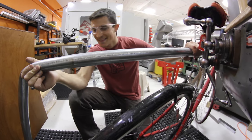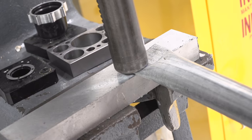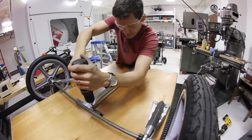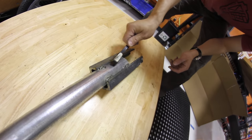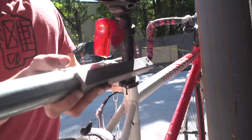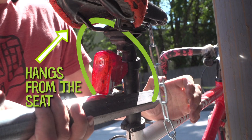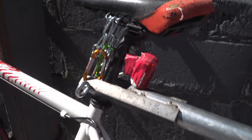Not too bad. Now I'm using a press to flatten the ends of the pipe. Then I'm welding on two bars that I can screw into the bottom of the trailer box. To make a hitch that will attach the tow bar to the bike, I welded on two pieces of angled steel. That forms a slot for the seat post to slide into. I added a chain so that the hitch hangs from the seat and doesn't rest on the seat tube. This bolt closes the open slot to secure the hitch.